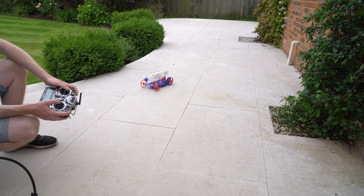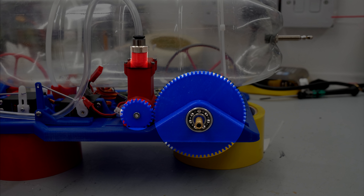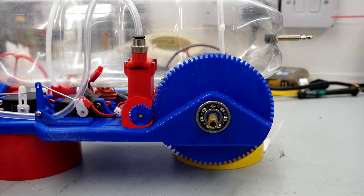So what's really happening here? It's all to do with the gear ratio and the air inlet valve inside of the engine. The engine is lacking in torque, so the obvious thing to do is to increase the gear ratio by either decreasing the diameter of the drive gear or increasing the diameter of the driven gear. The only issue is that in order to open the inlet valve inside the engine, a torque is produced by the engine in the opposite direction, and it is the job of the flywheel to overcome this and open the valve.